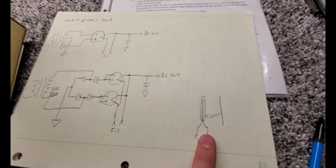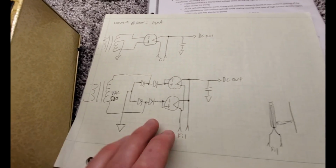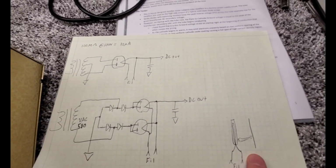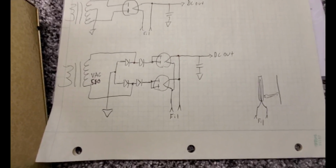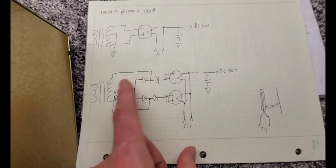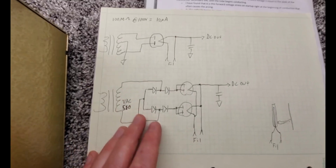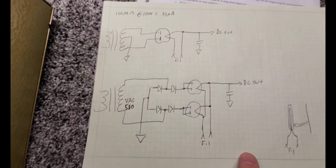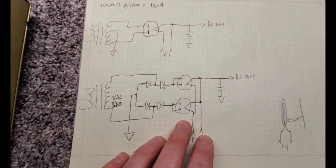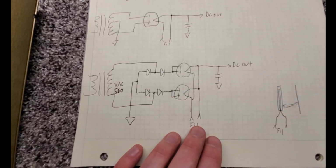So on startup, when the filament is just warming up and the plate to cathode voltage is essentially the full voltage of the winding, because our capacitor is discharged, we can get an arc. And data sheets talk about this in tube rectifiers. That's why, for those who are familiar, tube rectifiers have a maximum rated capacitance they can work into and a minimum AC resistance to limit the potential current flow for this startup condition, and also to keep the current ripple of the rectifier in check in steady state as well. So we're adhering to all those guidelines by a pretty large margin in 2845.